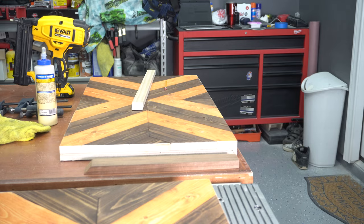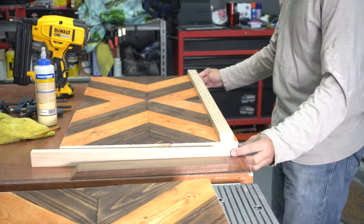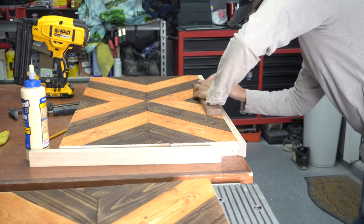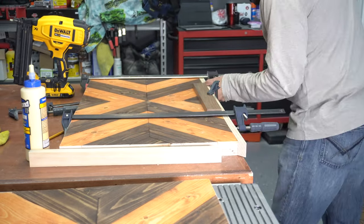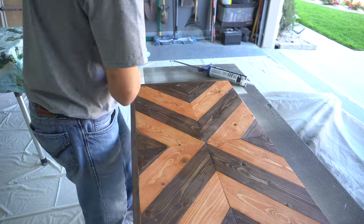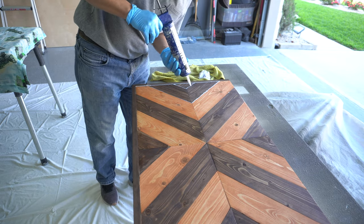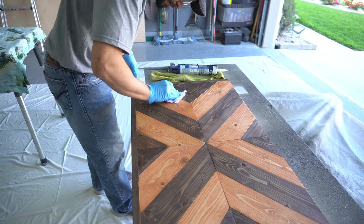Now I take the time to add trim. I had previously rough cut these, but now I'm measuring to cut them to size. It's a matter of adding wood glue using my specialty glue spreader and adding a few brad nails to hold everything in place. I decided to add clear caulking between all cracks and crevices. I let everything dry for a day, then came back and added wood putty — this ensures the crack is filled from top to bottom. Then it was all a matter of adding my top clear coat, which I applied using a paint sprayer with some sanding in between each coat.